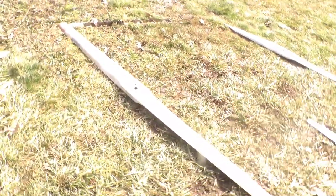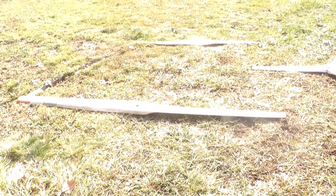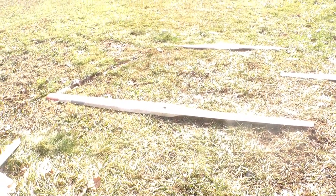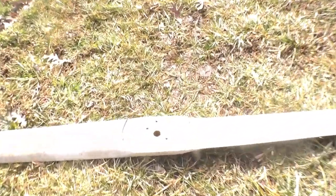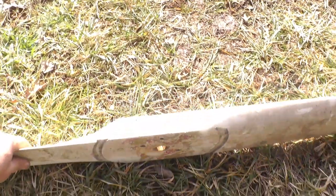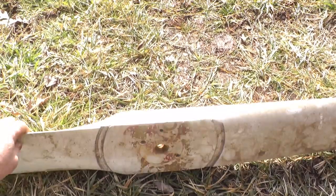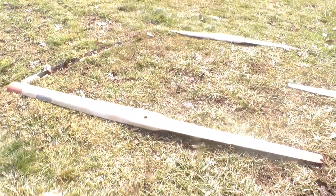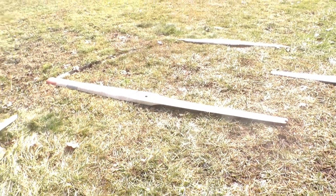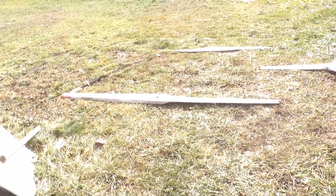And the generator that's in the Waterwheel building, that's a propeller I made for it. I think it's 8 foot. It was a 2x6, and I did the same with that, carved it out, and it had a brake drum on it off a Volkswagen, I think, and I had a brake on it. When the wind got really wicked, I had a big weight that I hung on it, and I put the brake on.